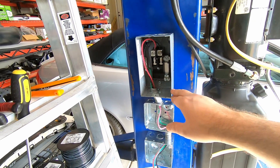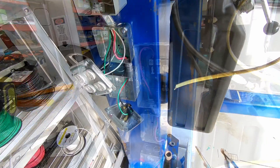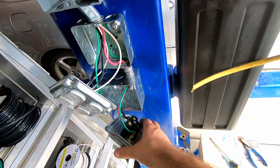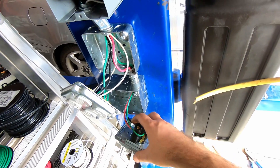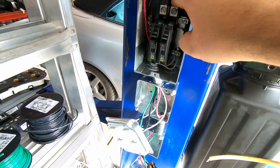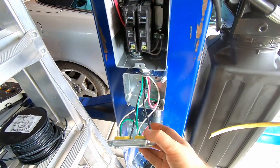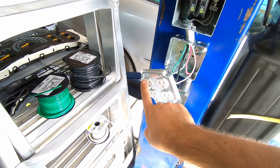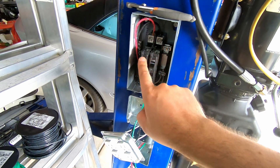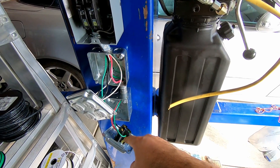The second part is the 120-volt outlet, which is gonna run from here up to those breakers. I just finished the hookup of the lower portion. Red and black are the two hot wires going to the 240 outlet, going all the way to the top where they'll meet with the wiring coming in the conduit from above. This 120 outlet and the 240 outlet are two separate circuits, each using separate breakers — one breaker for the left circuit and one for the right circuit.